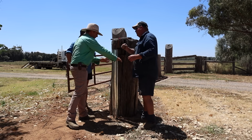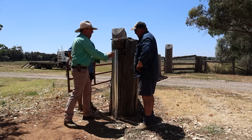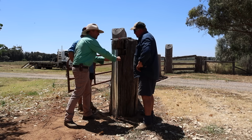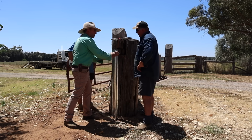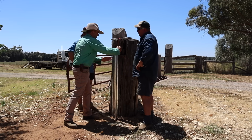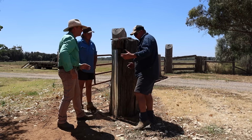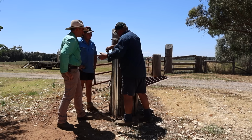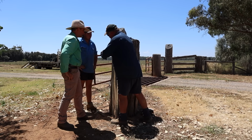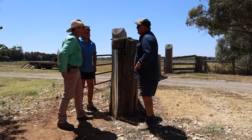Sometimes people will, it's quite common practice, if you're using the mast to control where your post is, you'll quite often put a snig chain around the post and that allows you to pull the post over without having to touch it while you're driving it, is that correct? Correct, yeah. So you were putting your arm around the post to put the chain on, and what happened? Yeah, so put the chain around, went to slide the chain up and the hip has hit the lever and down come the mast.